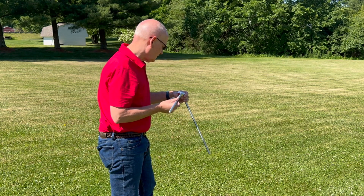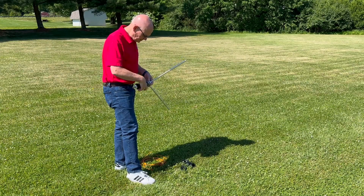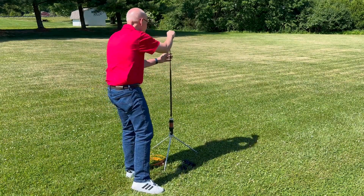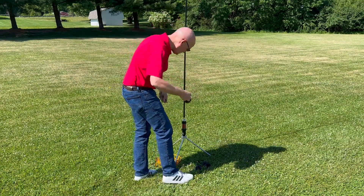Setting up the antenna with the optional accessories is easy. Just assemble the Z-Pod, attach the coil with the radial puck, add the whip and the radials, and you're almost ready to go. Select the band you want to operate on and tune the antenna — you'll be up and running in no time.